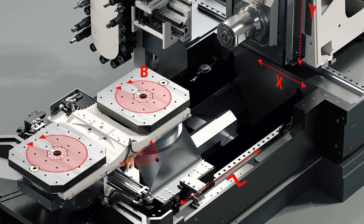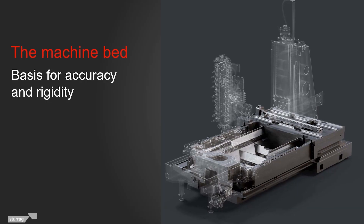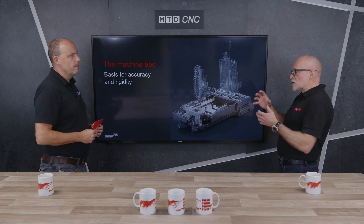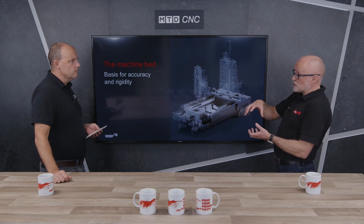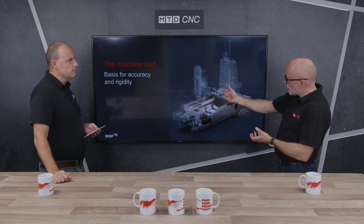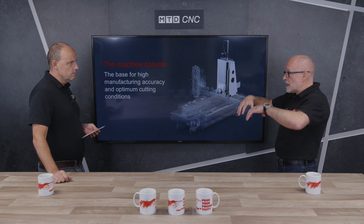In its basic form, it's a twin-pallet machine, a horizontal machining centre. With these machines you have a bed and a column. They're a very solid, compact machining centre — monoblock base. We use a mineral cast material which is very vibration absorbent as well as being very stiff. It's a very hollow design, like a big bathtub, so all the chips just fall straight out of the work area.